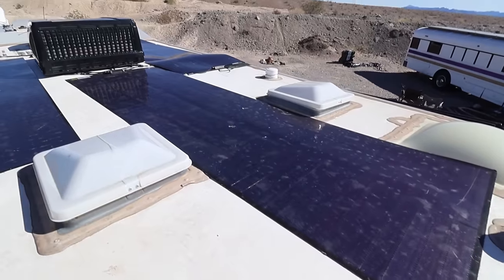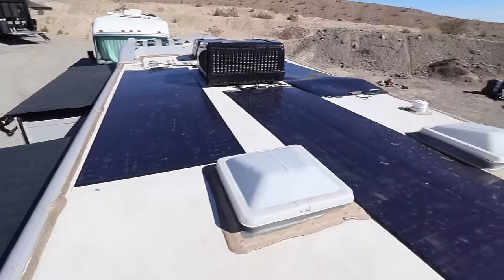After that completely dried overnight, the solar panels were applied one at a time, starting with the front and working our way towards the back. The grommet panel was installed last with typical roofing screws with rubber washers, and lap sealant was applied over and under the holes.